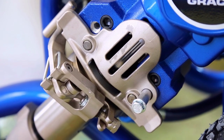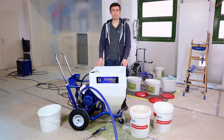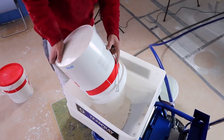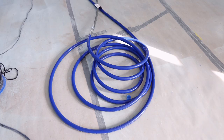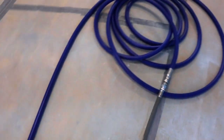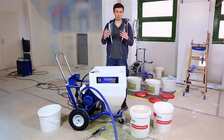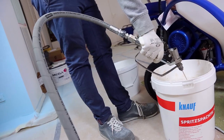For delivery, it starts with an integrated hopper of 80 liters. Then coming out directly is a hose of 15 meters in a wider size than the ones you have in the Mark series — even better suited for plaster spraying. With this will be given 5 meters more, this time in DN13 — the same diameter of hose as the Mark 7 or Mark 10 for example — so in 5 meters length.